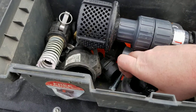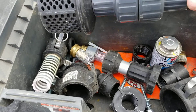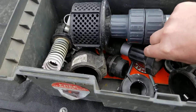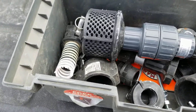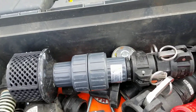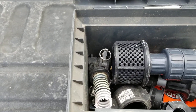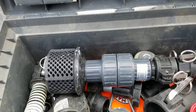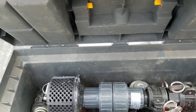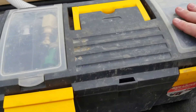There are extra bits and pieces. I was gonna go with a bigger bulkhead but it didn't fit, so some pipe cement. There's a fog nozzle here. The pump only makes 41 or 42 psi according to the specs — it's not a lot, but it's just about trying to hold and keep things at bay until the fire department gets there, or even put it out if possible.